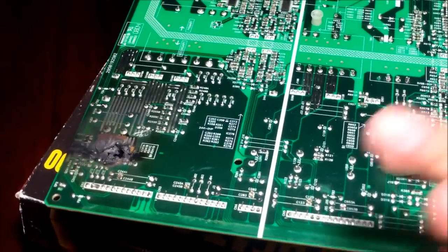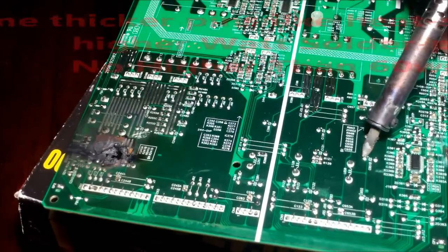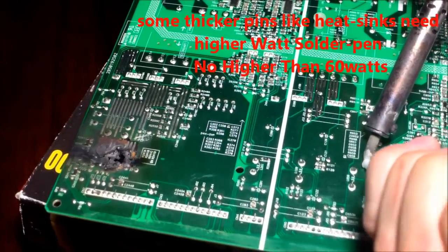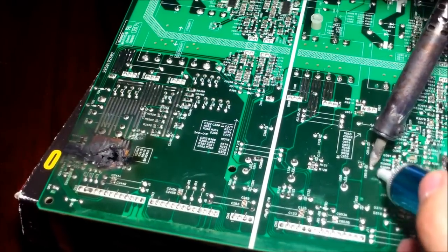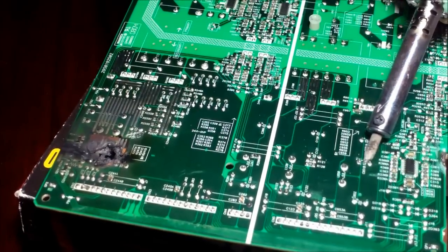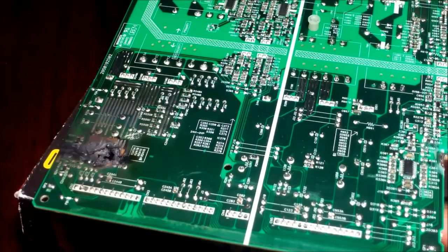Let's do it the other way and compare — take that one out with the solder plunger. So we heat it up, and that's one. The solder plunger is only like ten bucks. I didn't even heat it up and it just fell right out. Solder plunger wins again — that just fell right out.